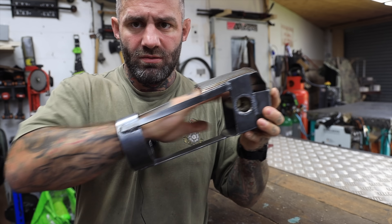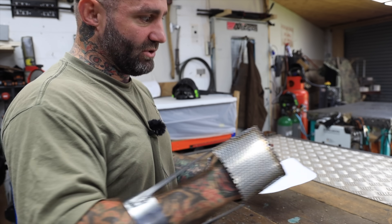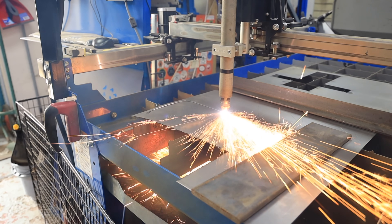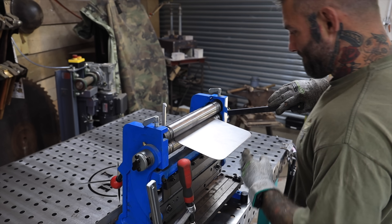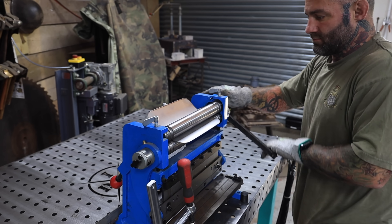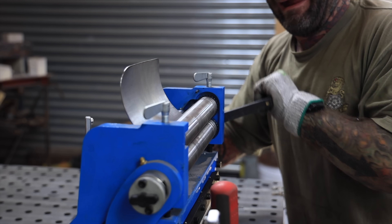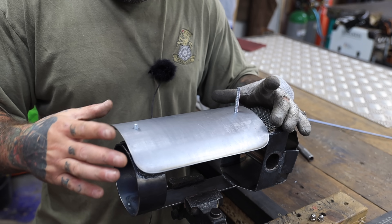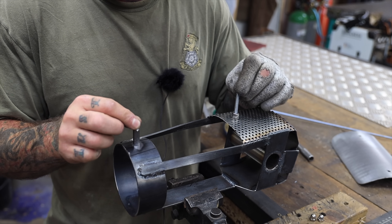All the supports are now welded on, it's a nice snug fit, and now I need to cut this out of some steel so I can make a raised shield — over to the plasma cutter. I've got the shield all fitted up now, I just added some spacers here to make it stand off, and I'm going to TIG weld these together and then shorten the thread. I'm going to use some dome nuts for the top.